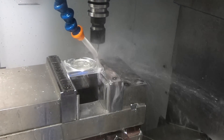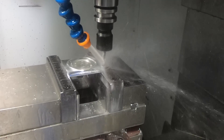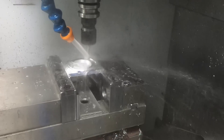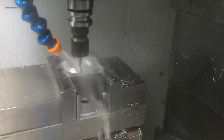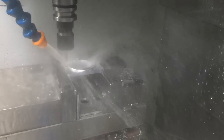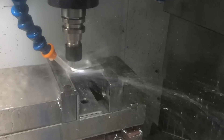Then removing material around the outside. The main purpose for doing this is so it's easier to see the slot between the two halves and tell if air is leaking during the pressure test. And then the thread milling.